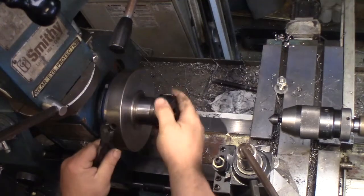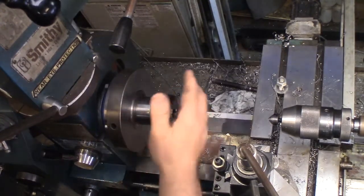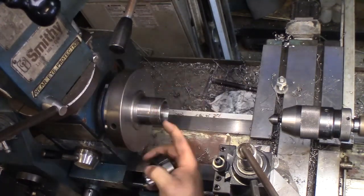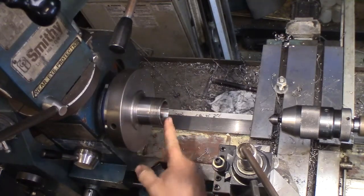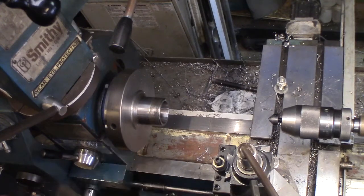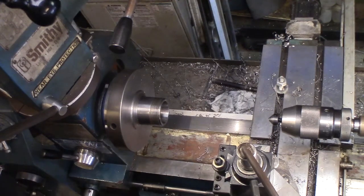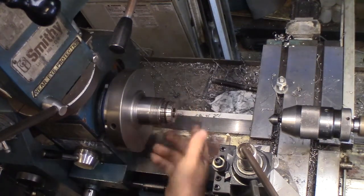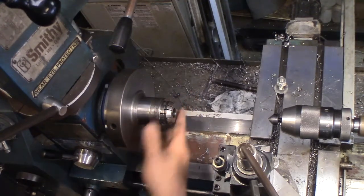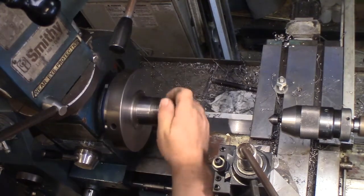And they're really cool because you make it a little bit long, which I did to get my table underneath it. But if it gets dinged or banged up, then you just freshen up your taper here with a small grinder, true it up, take a little bit off your nose. Whenever you work on your taper, your collet is going to sit farther back inside the chuck body, and you want it to be able to sit in good without the ring hitting the back end. I've got a while to go yet before I have to worry about that, so I'm good there.